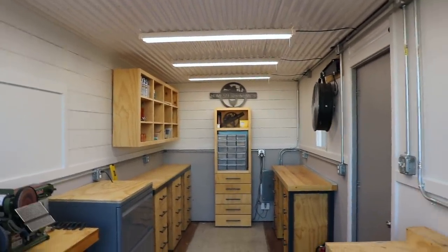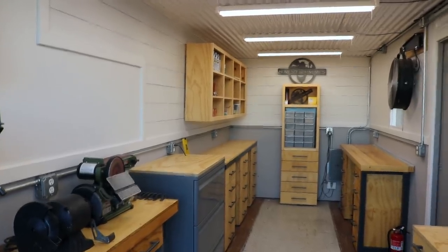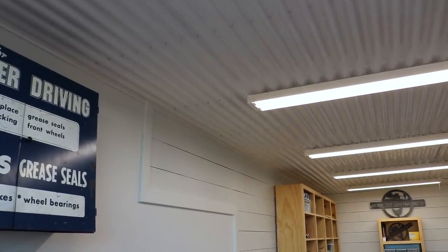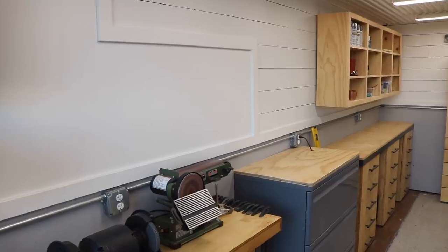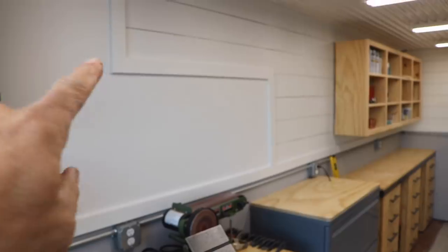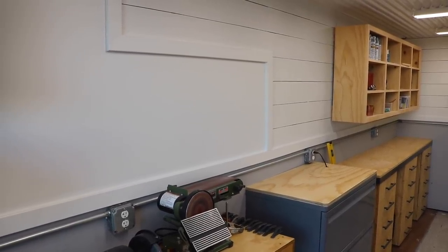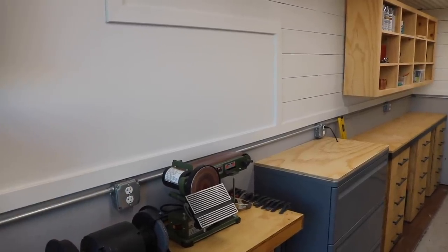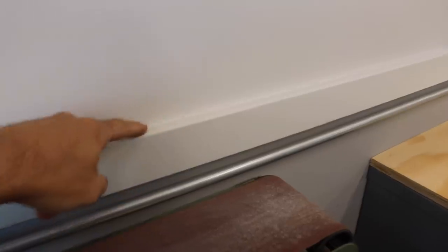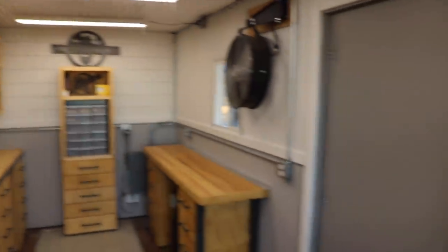Once I get different types of tool storage on the walls, there should be less flat surfaces for sound to echo off of. I also think it's a good product to put over a ceiling that potentially has some imperfections, because the corrugations kind of hide any issues. The next thing I did was replace all of the fence board trim that I had installed as a chair rail and in the accent section. I'm sure some will be disappointed because it definitely brought a warmth to the shop. But up close it had started warping, and it also had a gap behind it that collected sawdust. The new standard white trim I was able to caulk, so it's a tight joint and nothing will get stuck behind it. I know it does kind of white out the shop, but I'm pretty pleased with the overall look.